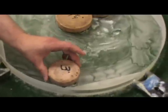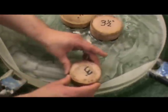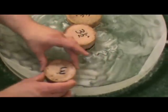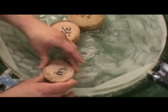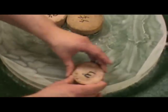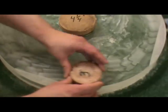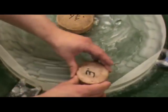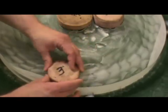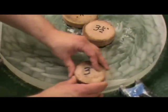So I'll actually execute it: one, two, three, inside — and I'm only moving it about a half an inch to the left. By doing that V off like that, it tends to blend the action of the little pitch lap in toward the center a little bit and spread the action around so that you don't get a big discontinuity where the left-hand edge of the lap hits.